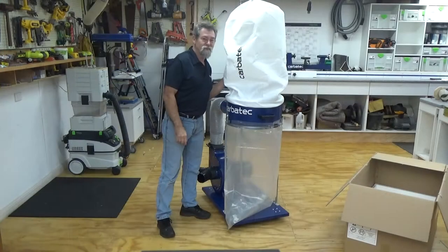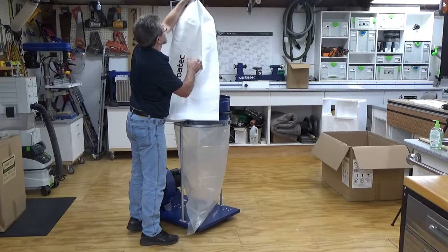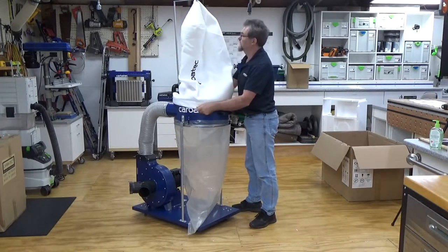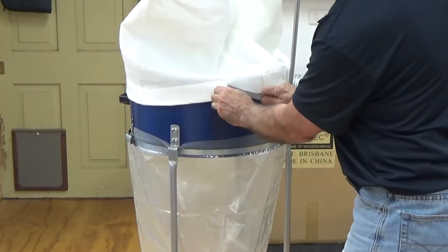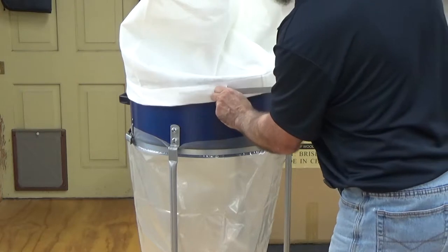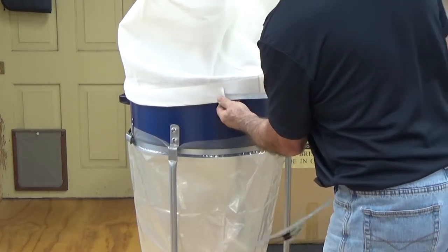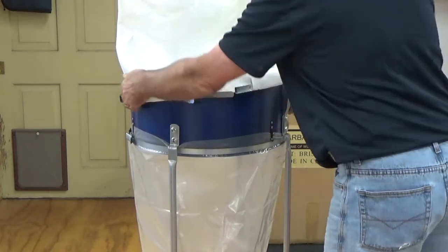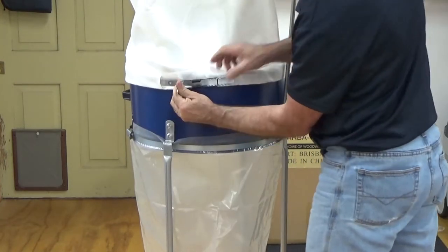Place the 5 micron needle felt filter bag onto the supporting arm at the top of the unit and slide the base section of the filter bag around the top of the main body of the dust extractor. You'll notice that there are two slots in the bottom section of the filter bag — this is for the band clamp to be slid through. Do this slowly; when the leading end of the band clamp is visible again, help ease it out of the pleat and fasten to the other section of the band clamp in position and tension, holding the filter bag in place.